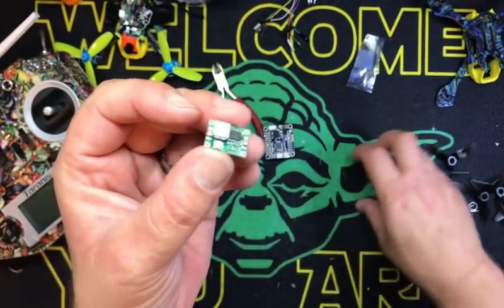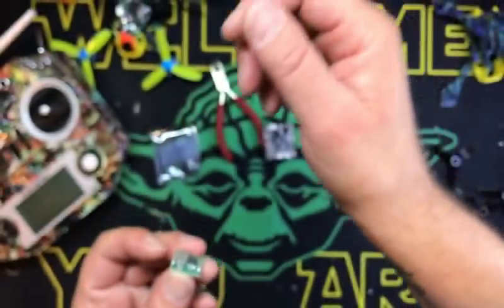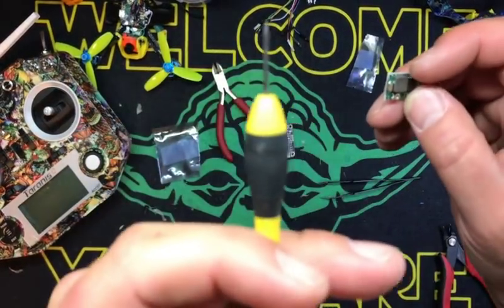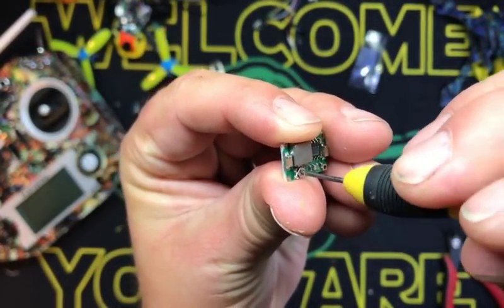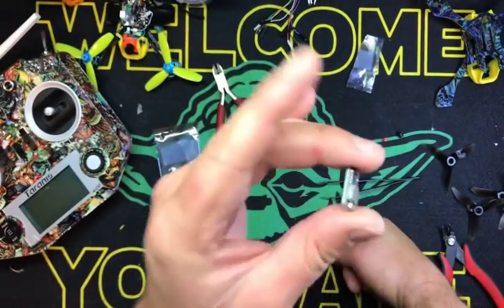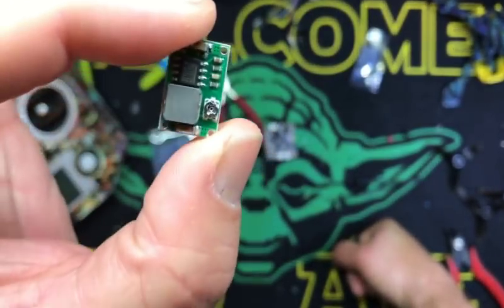Basically, there's a little bit of guts you don't care about, but there's your potentiometer right there, okay? And that little dude, I have a special screwdriver that I use, a real tiny flat blade right there, and you can adjust that. I can't even remember what my voltage output is on this. I think it's like from 12 to 3 volts, but don't quote me on that. Look in the description and it'll say it. But if you look at the bottom, you can buy a handful of these for about $5.